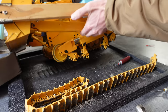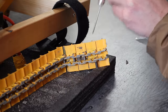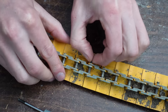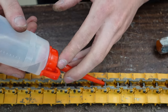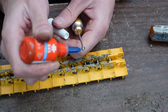It turns out that the track design of this thing is really bad. The pins that hold each track link together are just pressed into place and held in by nothing more than friction. These things would wiggle out of place pretty frequently, so after every drive you have to go around and hammer them back in. I used red Loctite to hopefully keep them in place more permanently, and then oiled the pins to reduce friction. The replacement track links I ordered included a new type of pin held in place by a screw head, so that's nice.